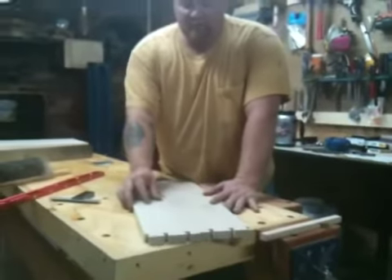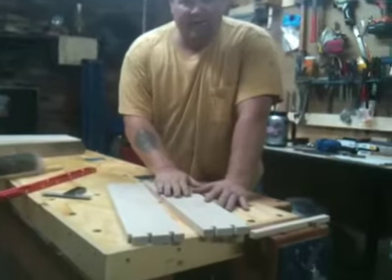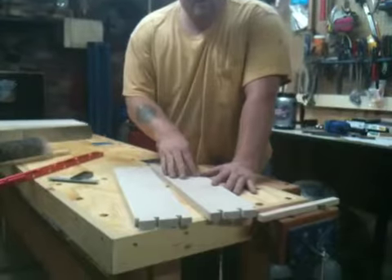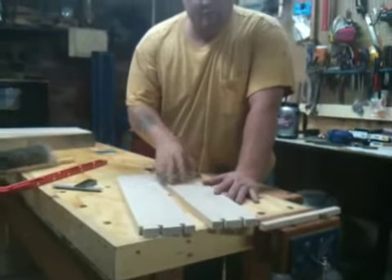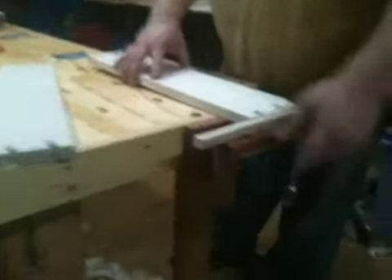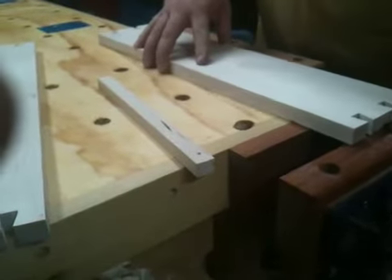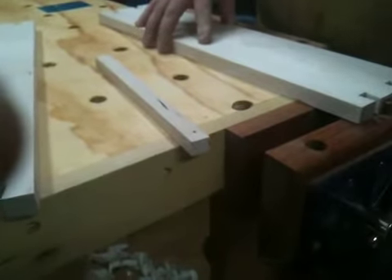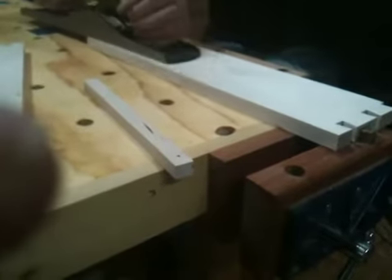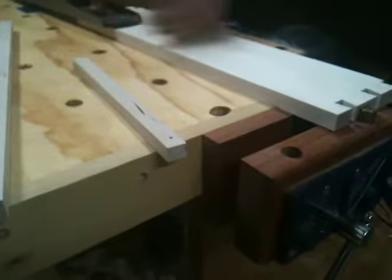What I had to do was I took the wide boards that had the dovetails on them and had to cut them in half. Now I'm going to take the hand plane and plane them flat. Then I can run them through my planer and get a really true flat surface so that the dovetails come out nice and crisp. I'm going to clamp this up in the workbench and take our joiner plane and plane these things really slick and have a nice flat surface.